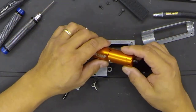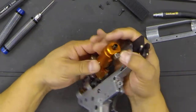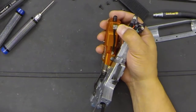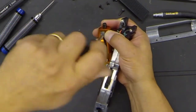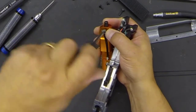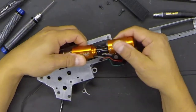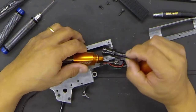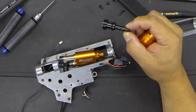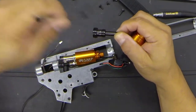But for just the point of maintaining, or say we wanted to lubricate the nozzle, it's as simple as undoing the front banjo screw here, banjo fitting. And since I've already loosened those 2 side screws, this comes right off. And here's the nozzle. And we could reapply lubrication to the nozzle, keep this nice and goopy here.